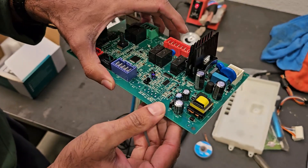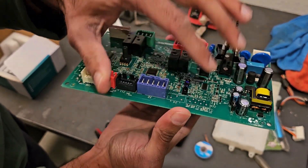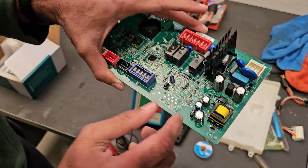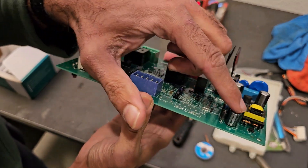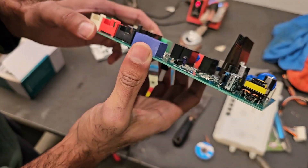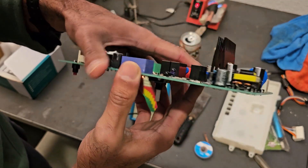I'm going to put a replacement back on there and see if that fixes the issue of that lid lock light just continuing to blink. I'm going to see if I have that capacitor on hand. I'll also go ahead and test the other two as well and see if they're acting funny. But before I go and do anything with the relays, I'm going to replace that one first and see if that solves the issue, because the ESR on this capacitor was very large.